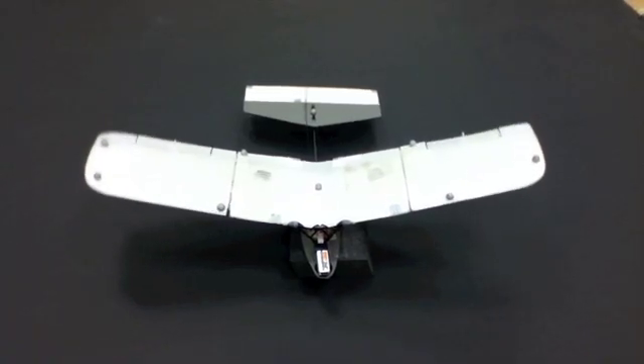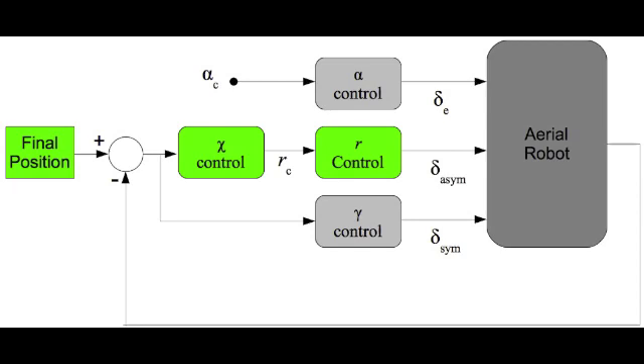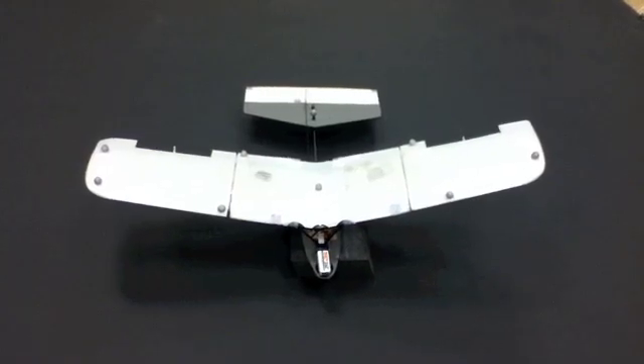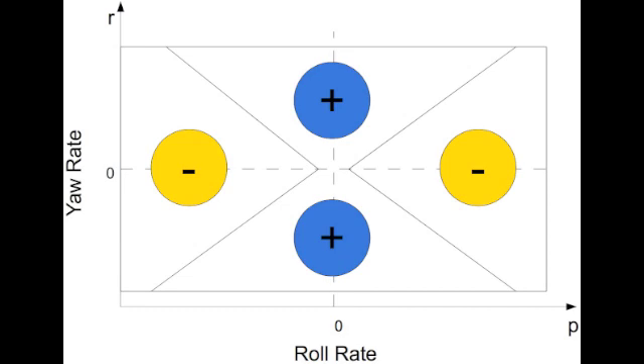The antisymmetric component of the wing dihedral is commanded by a two-stage controller which stabilizes the lateral directional dynamics and regulates the aircraft heading. Trailing edge flaps deflected in a symmetric configuration help ensure uniform yaw control effectiveness across the flight envelope.